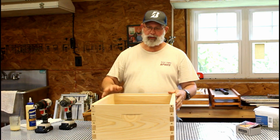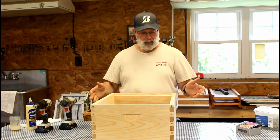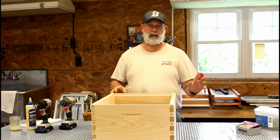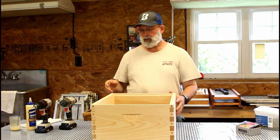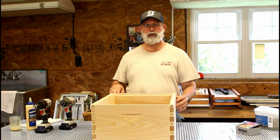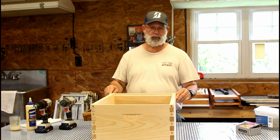Okay, now we have our box screwed together, and it is square, it is level, and I will put in the description the type of screws I used, the size I used, and the drill bit I used on this CYPRESS wood. Just always be sure you pre-drill all your holes, and make sure you use the smaller screws in the top holes, because it will split if you use the 8 by 2 inch screws.